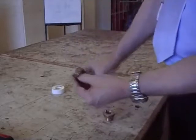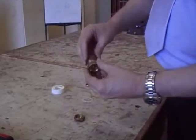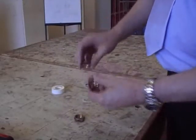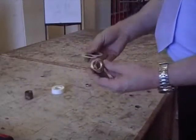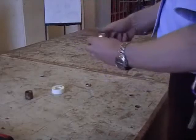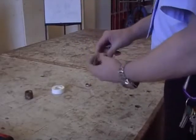It's so very easy to put the wrong one on, especially when it's on the tank. The wrong one, which I've got now, if you screw it on, you notice it goes on two turns and it stops. And if you've got the olive on there, you think it's hit the olive, and then you wind it up with a spanner, and obviously it won't tighten up.